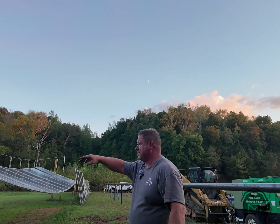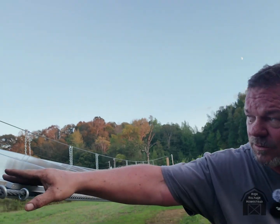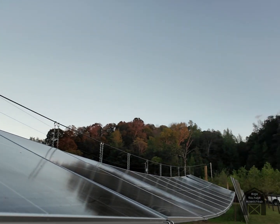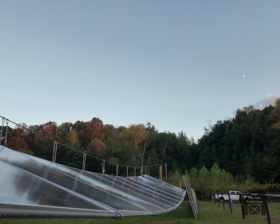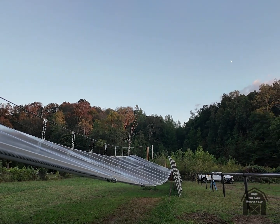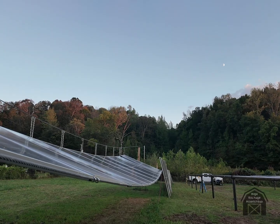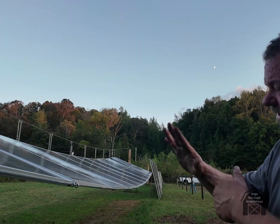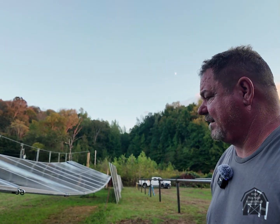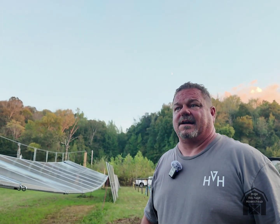You can see where this panel has kind of crawled up on the other panel at the top, and the same thing happens on the end down there. If you had a post in the middle that would probably solve it, and if I had panels on the other side that would probably solve it too. Then you can just tighten and slack the winch and it rotates the panels around a single axis. But I'd have to lower this one down quite a bit — the whole process would end up being a lot farther off the ground than I wanted, and honestly it's just a little sketchy tightening a three-quarter-inch cable with a 12,000-pound winch and watching a six-by-six bow with a kicker on it.